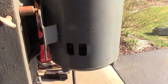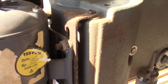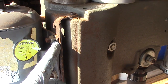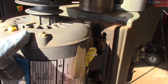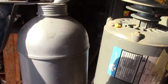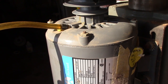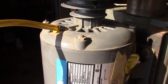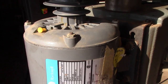It's kind of odd that they mount it like that, because I noticed online when I was reading about these drill presses, a lot of these brackets on the motors have broken over the years on other people's drills. I'm doing a little maintenance too — I blew out the motor, there was a lot of dust in there. I pulled off the oiling cap and I'm going to use my pump oiler, which has a really nice thin brass nozzle. I thought it might be a bad design, but the hole actually travels downhill so that oil will roll into the bearing.